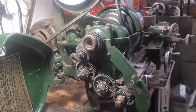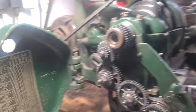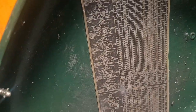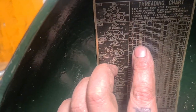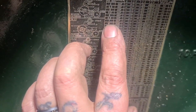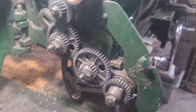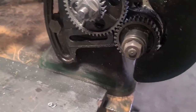This is Atlas Spindle Protector, part two, take two. Let's do it. I've changed the change gears according to the instructions. Look, there's this really old guide on there, and it's got 8 TPI. We need 48 and so on. Bush, done, sorted. And whenever you're changing these, give yourself plenty of lash.